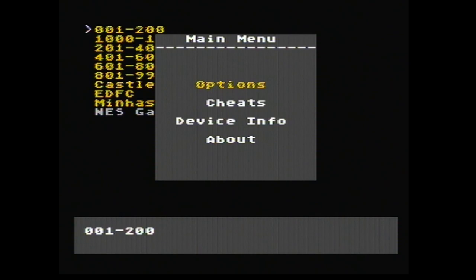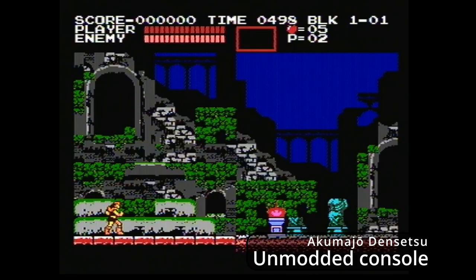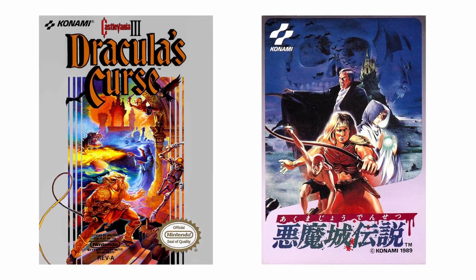The best results I got was from connecting pin 54 on the cartridge slot and pin 1 on the CPU with no resistor whatsoever, but the expanded audio was a bit lower than the original sound. Thankfully, the flash cart firmware has an options menu that allows you to adjust the volume for the different expanded audio mappers supported. Bumping the volume a bit did the trick, and here's a before and after comparison — directly from my NES clone console.